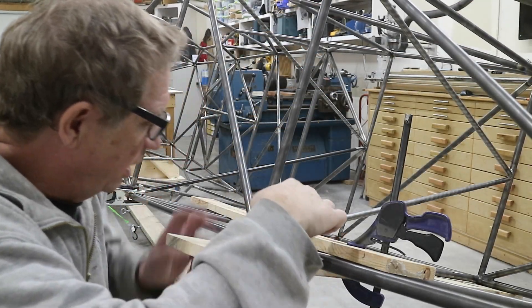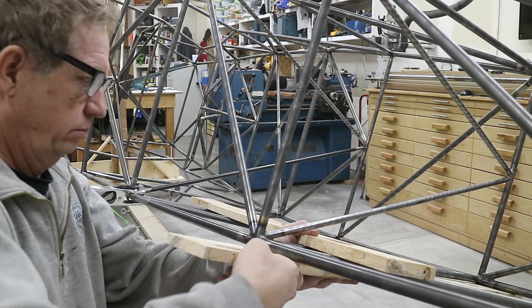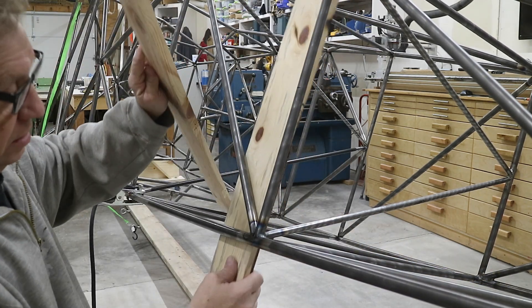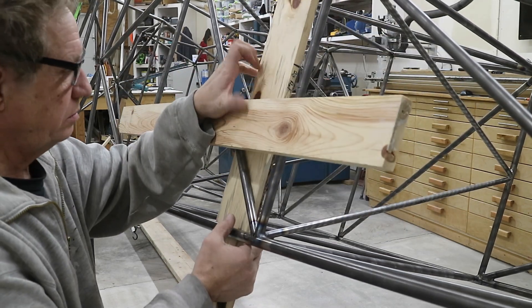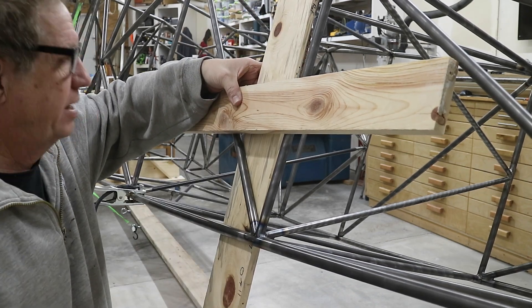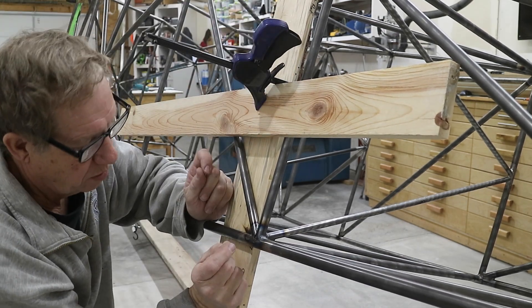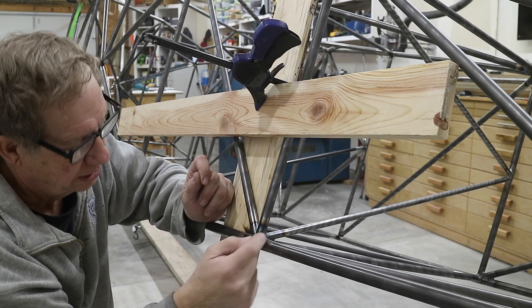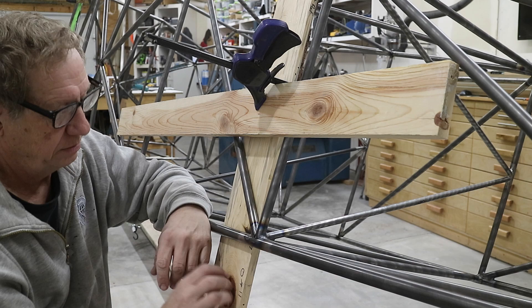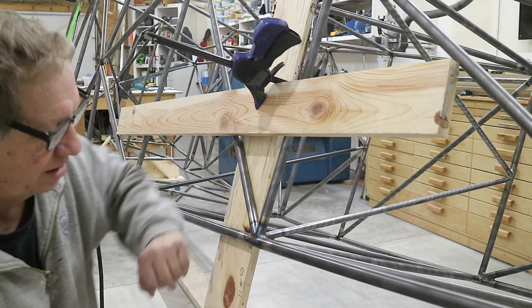I've welded the inside of this cluster and I need to weld out here. To put these boards on, what I'm going to do is set this guy like this - and that will give me somewhere to put my hand down here. There we go, that will work well. Filler and torch, and I'll just come from that weld over. Having that support versus trying to put my hand on the tube or use my finger just comes out so much better.